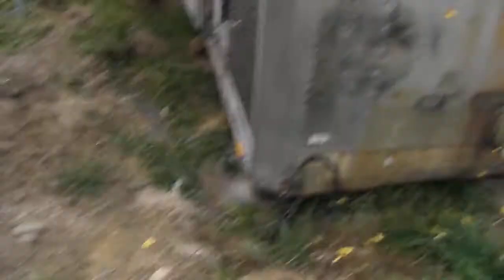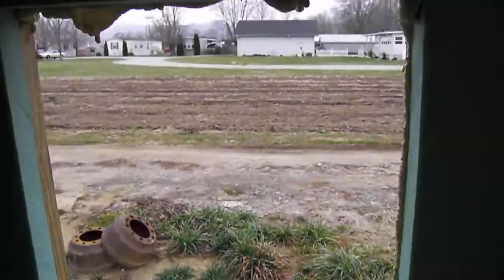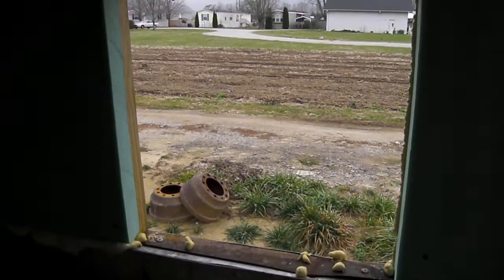Spray foam in between, and then the wiring. I set my electrical panel up pretty close to where the coolers were going to go and I ran the cables there. I was able to do all that myself without any prior experience. Each of these units requires its own circuit. You run a 12-2 cable and a 12-3 cable in, because you need that neutral wire to run the CoolBot unit, which runs off 120 volt. And if you wanted to plug anything else in, like lights or a heater at some point — on this one I did leave a hole with a plug in case I wanted to stick a box fan in there and circulate air, just to leave options open.